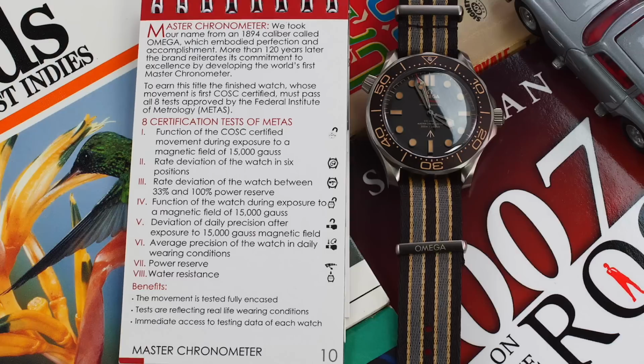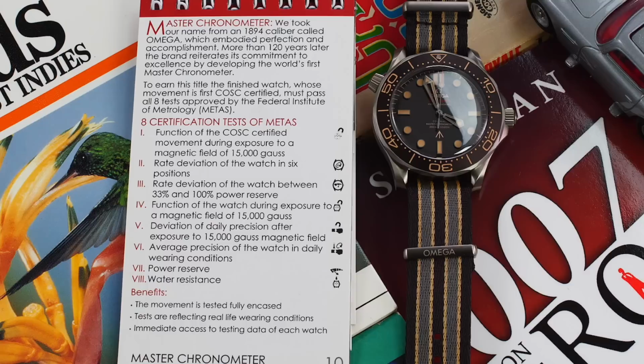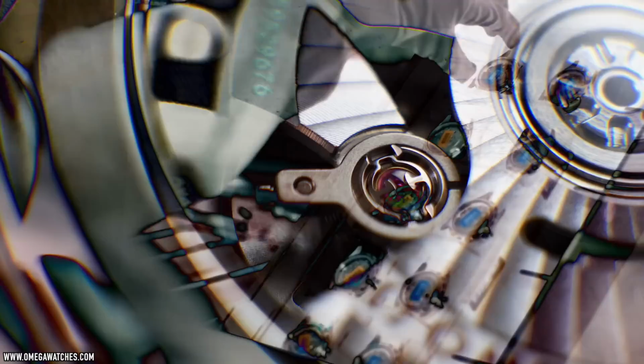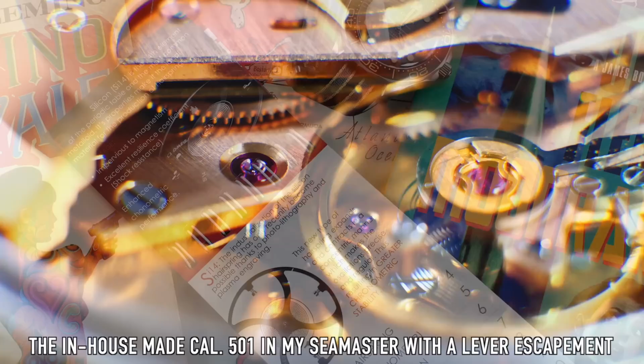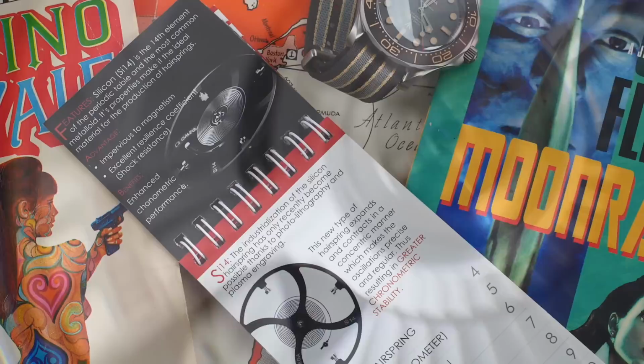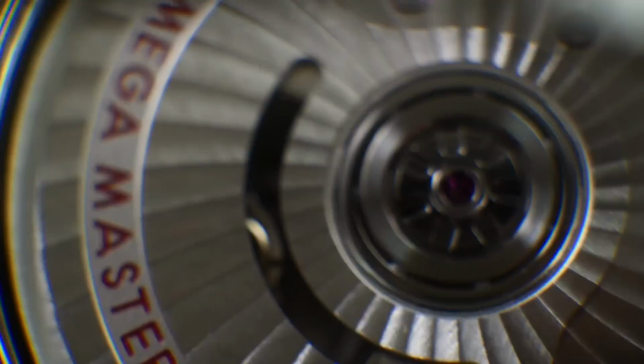And I'm really pleased about this because it's a return to competitive cutting edge mechanical movements before the slightly dodgy 70s and the fallout from the quartz crisis. I mean, these movements have been the culminations of decades of improvement and evolution. And not only do we have the coaxial escapement, which is the biggest change to one of the most significant horological advancements since the invention of the traditional lever escapement, but we also get a free sprung balance, silicon balance spring, bidirectional winding, stunningly beautiful rhodium plated finish with this Geneva waves in an arabesque pattern that really highlights the sense of motion.